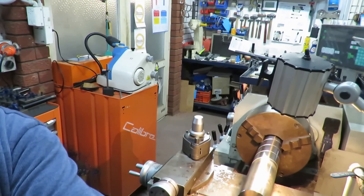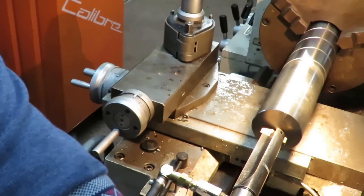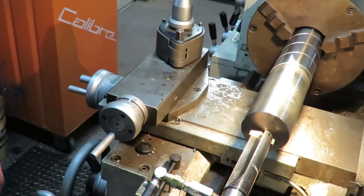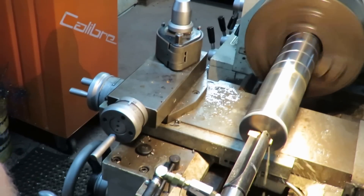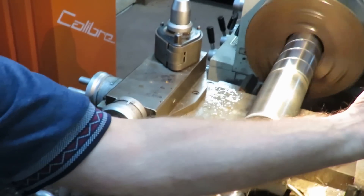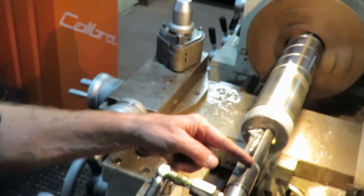I'll bring that in — see if we can pan and bring that in a bit. Bring the unit down and across a bit so you'll be able to see how we go with this drilling. We're running at 270 RPM. She plays around a bit until it actually gets close to the full bite, so it bounces a bit and we'll lead her in slowly. There's the fluid coming out, as you can see — the coolant. That mark there is 100mm, or four inches.